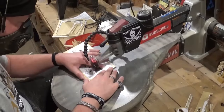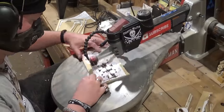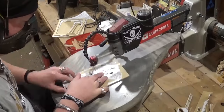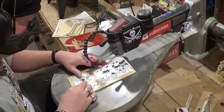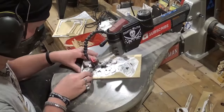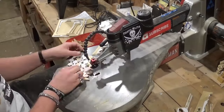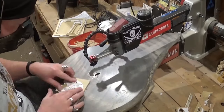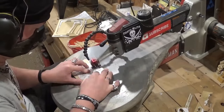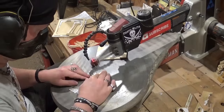All in all, the scrolling and cutting out the top and base took me around two hours — I was just lost in my world with some good music on. I have my little red plastic bin to my left and I'm putting all of the pieces into it so I can keep track of everything; I didn't want to lose any of these small pieces. The project also has a lot of veining in it — that's simply where you run the scroll saw blade into a cut line and then back it out while the saw is still running to create a line of detail. You can see me doing that now to one of the fish.